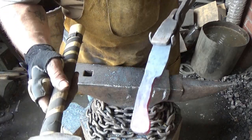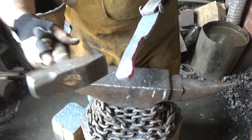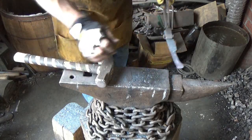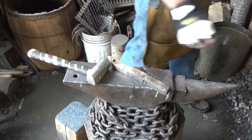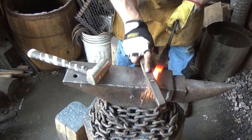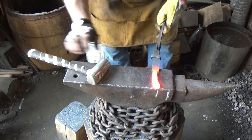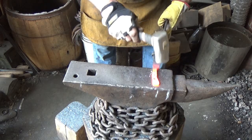This part here, and then you can see it in there where the center is, right? Because it rolled, it didn't roll, but it bulged a little. Now that center has hammer marks in there. We need to get rid of that because that's just a grinding nightmare. All right, clean it up because we don't want anything else attributing to it. Just going to try to run this rounder right down through the center here. Smooth those out.